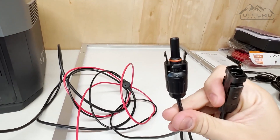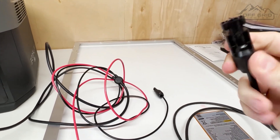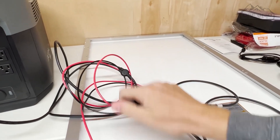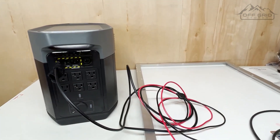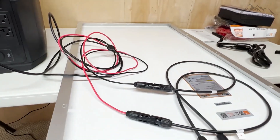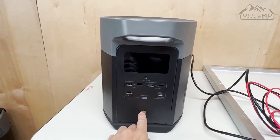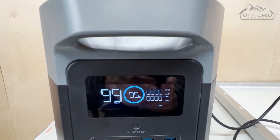Although this one does have a red band on it, it's not coming straight out of the panel. So you take the negative side, the female connector, and plug it into the male. There we go — this is it, all plugged together. The panel is currently facing downwards and is not outside, so if you press the button you'll see the solar input is reading zero.